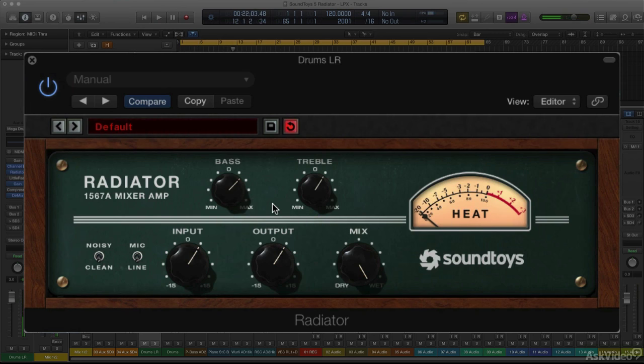And remember, the EQ section feeds through the output knob into the second tube saturation stage, so cranking up the bass and treble controls will drive that stage harder at the high and low frequencies. This will give the EQ a subtly different character.